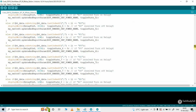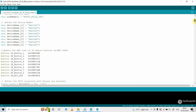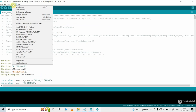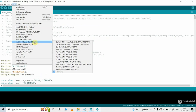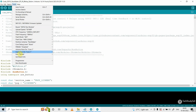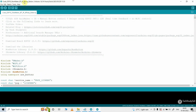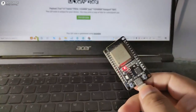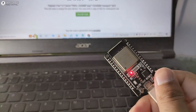So if you go through the code, you can easily understand. If you refer to the same circuit, you just need to change the hex code of the IR remote buttons and, if you want, change the device name. After that, go to Tools, select the board as ESP32 Dev Module, and the partition scheme will be Rainmaker. Select the proper port, then hit the upload button. After programming the ESP32, now we will add the devices to Rainmaker.